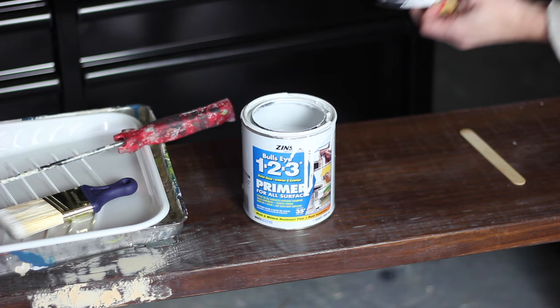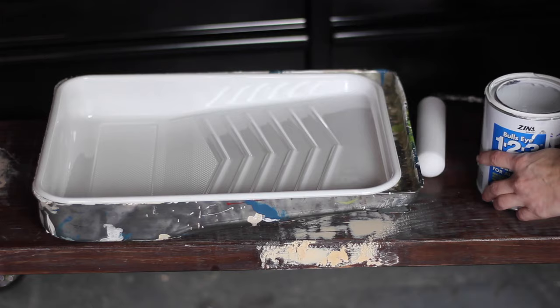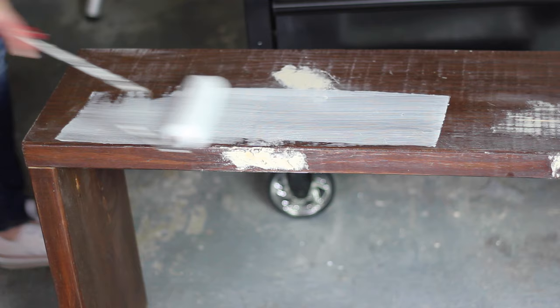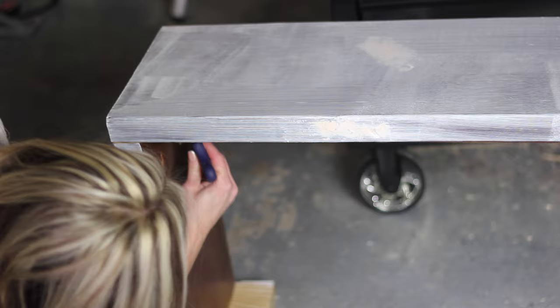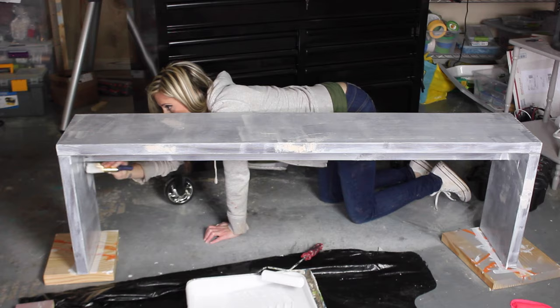Now that the piece has been prepped, it's time to prime. I use a combination of a mini foam roller and an angled brush to apply my primer and my paint. The brush is helpful for getting into the crevices and then I use the roller for the rest. Make sure your foam roller refills are made for smooth surfaces. I usually use a separate stain-blocking primer even if my paint has primer included — I generally use Kilz or Zinsser interior latex primer. I usually stick with water-based primers and paints, and I find it helpful to place pieces of scrap wood underneath whatever I'm painting to elevate it off the ground. The key is to apply thin coats of both your primer and your paint. I only use one coat of primer and then allow that to dry completely.